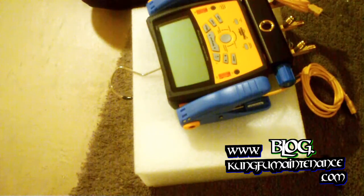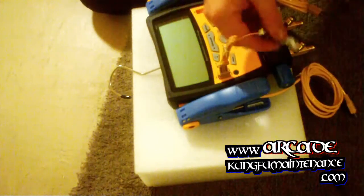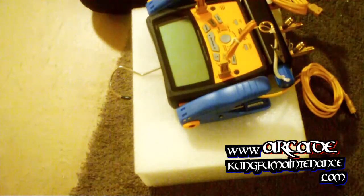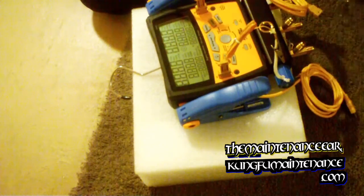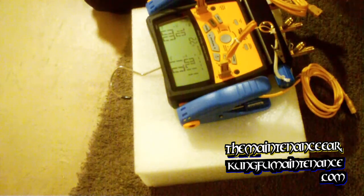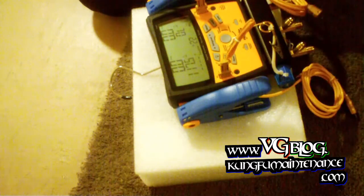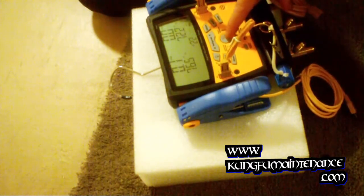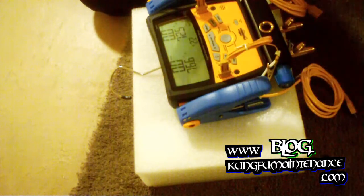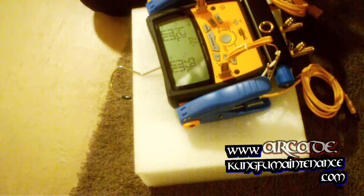So the wet bulb goes into T1 and the dry bulb into T2. So there's the wet bulb in T1 and dry bulb in T2. Fire it up. See what our temperatures display. And there we go. That's about right. 76.5 degrees in here. 76.6. I've got my AC going now. Seems the dry bulb is showing 72.6 right here.